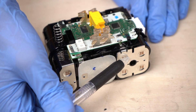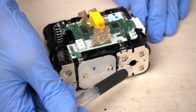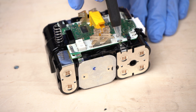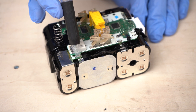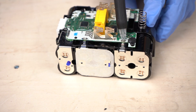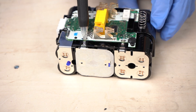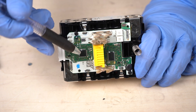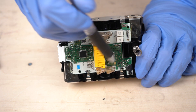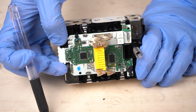Metal plates are spot-welded to the battery cells to connect them together. The metal plates are connected to the control board through thin metal parts — connected here and here. On the other side of the battery, in the same way, the metal plates are connected to the control board at this part and this part. From here, the batteries are connected to the control ICs, which constantly monitor the battery voltage and activate protection when overvoltage occurs.